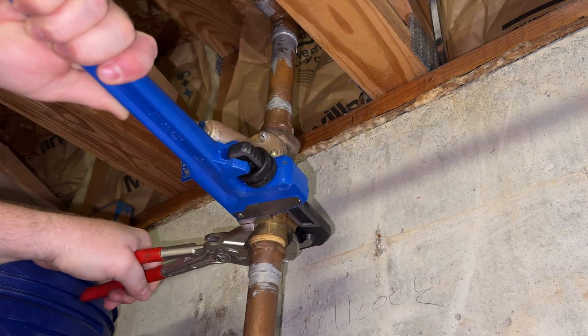What's cool about this new one is it has male threads on the outside and female threads on the inside. Clean any old teflon tape that may still be on there. You could either use pipe dope or teflon tape — I got a habit of doing both when I was in the fire sprinkler trade. Depending on how thick your tape is, four to six wraps should be fine. Also make sure you're wrapping your tape the right way — if you're not sure, think of it as if you're looking at the face of the pipe, you wrap it clockwise.